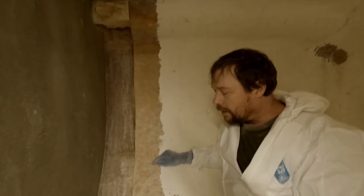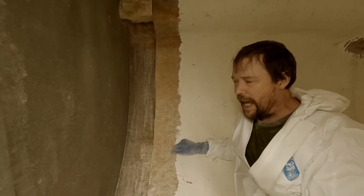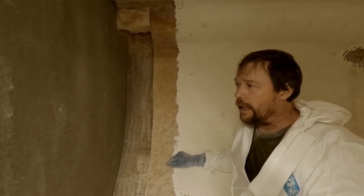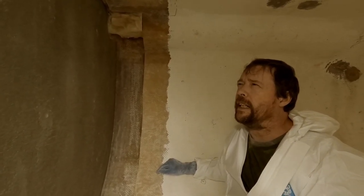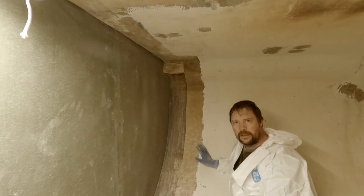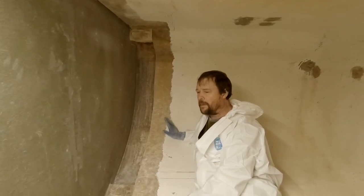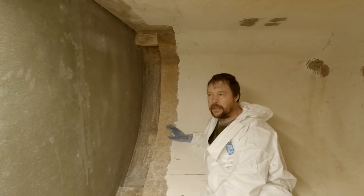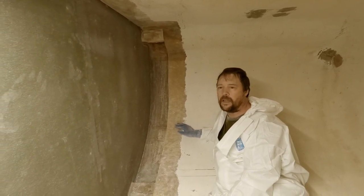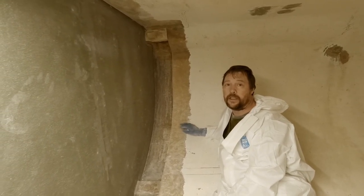It's almost impossible to really goof up fiberglassing when it comes to actually putting the stuff down, as long as you wet your material out well and don't oversaturate it, but don't make a dry layup. But I think the important thing, just like about everything, is in your prep. If you don't prep a house well before you paint it, your paint's gonna fall off. Same thing for your car. It's all about the prep work, and that's where you're gonna spend a good majority of your time.